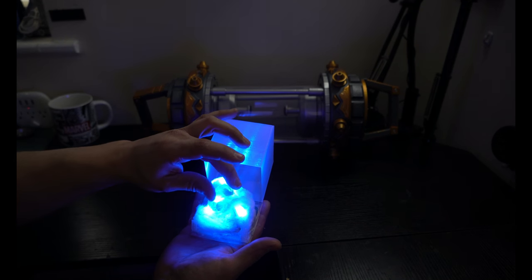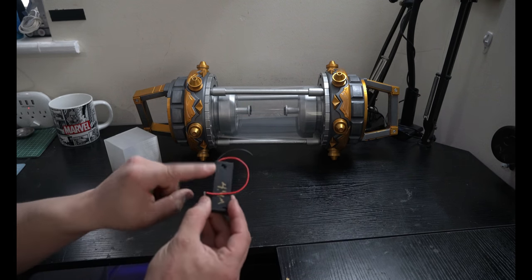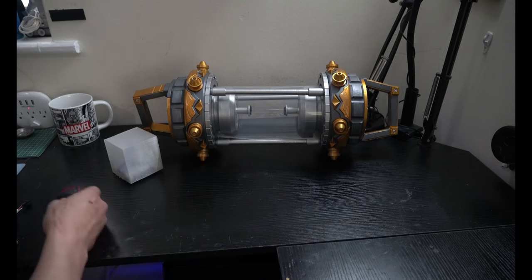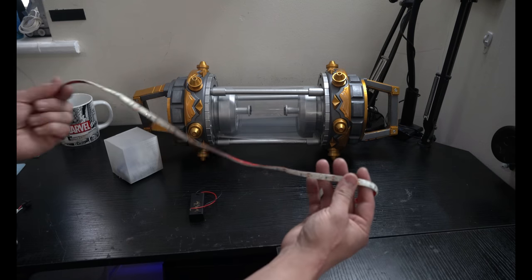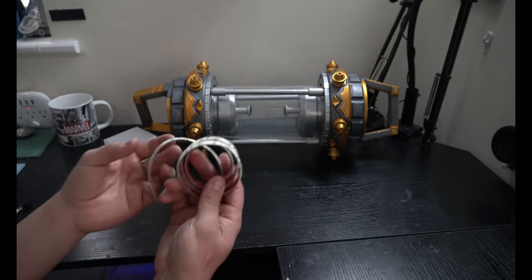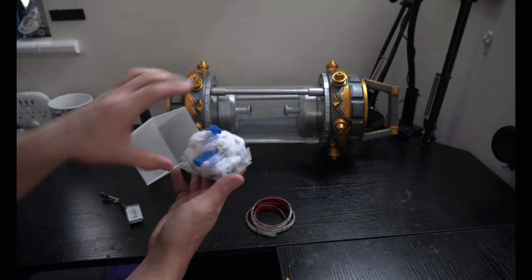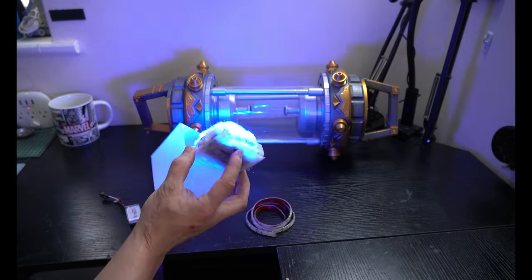The stone sits on some metal wires and a magnet. The system comprises some pretty basic components — a little switch pulled out of cosplay LED eyes. Remember, that switch only puts out three volts and the LEDs I have require five to seven volts. This is just a blue LED strip — you can cut it, solder it, bend and bunch the strips inside the Tesseract. I'm using a rechargeable 7-volt LiPo battery. The circuit is simple: battery goes to the switch, the switch goes to the LEDs, and that's it.